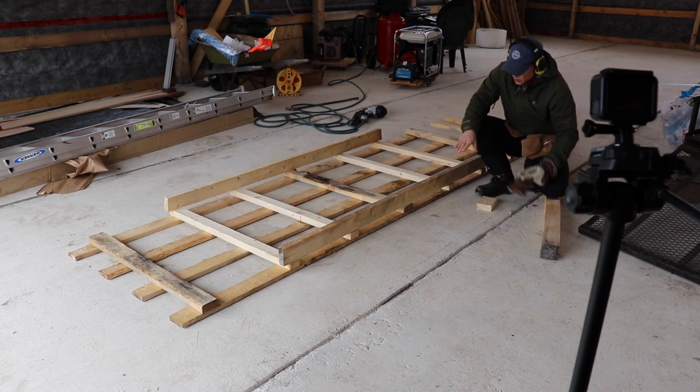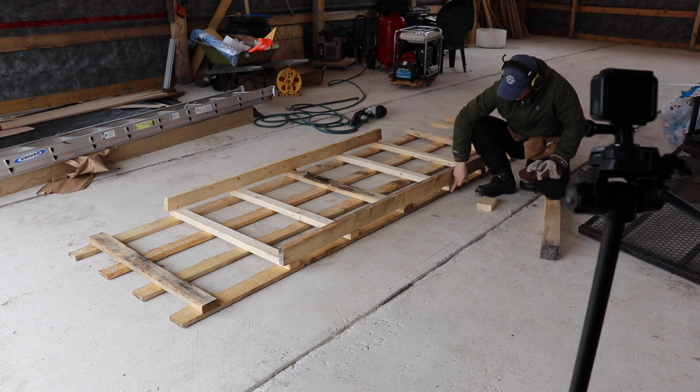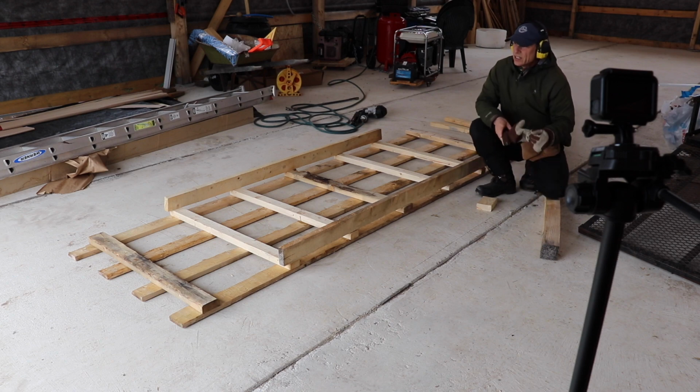I want the top of my workbench surface to be about 36 inches off the ground. So when I take the length of my caster wheels into account, that I've already got the dimensions for, the 1/2 inch for the plywood or particle board top that I'm going to add, along with the depth here, which is 2 3/8 inches, I add all that, subtract it from 36, and end up with 28 3/4, which is what the length of each leg needs to be.